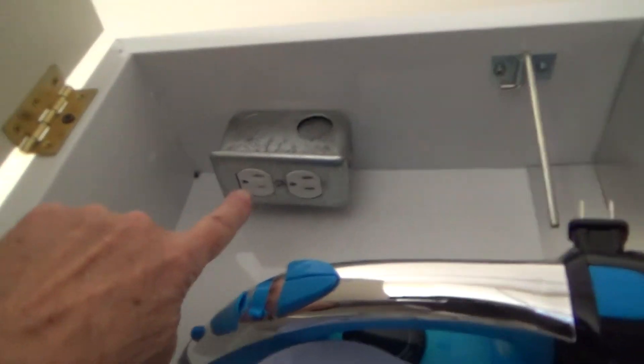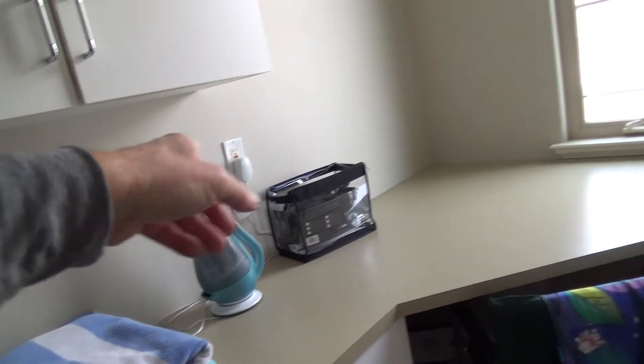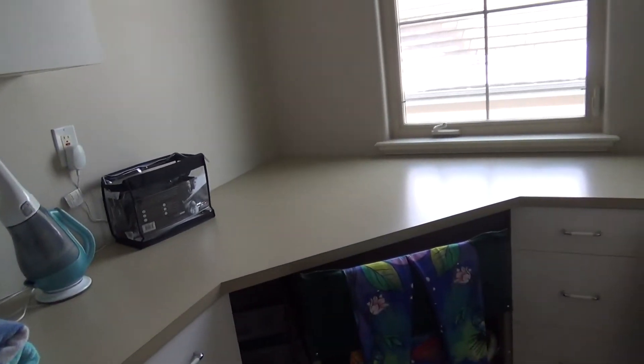Here's a thing I noticed — there's a plug here and that's for this little ironing board that folds down, then you plug in the iron to that. I think that's on its own dedicated circuit. In the electrical panel I happened to see it said 'laundry iron' or something, and I thought okay, that's for the ironing board. Could they have hooked that up with the GFI in here? Maybe, maybe not — maybe they figured the iron takes up a lot of power so they don't want to question having stuff on here and then have the iron on too.